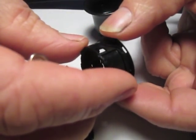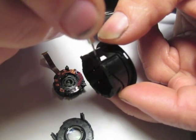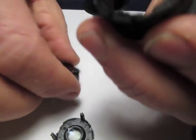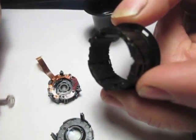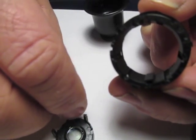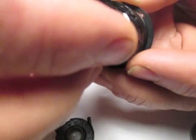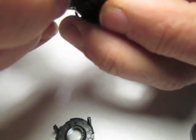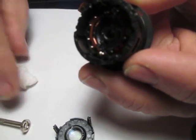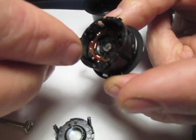You can see I'm coming around where this indexing window opens up on the front. I'm going to keep these two edges of the indexing ring and the indexing sleeve lined up, and hold it in place with my fingers until I can get my aperture assembly in place. I'm going to insert this so that the aperture cable is right underneath that letter tab, then push it into its tracking grooves and push it all the way down.